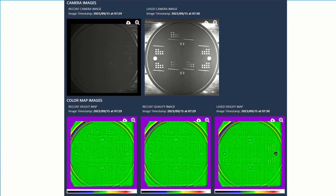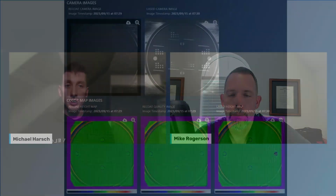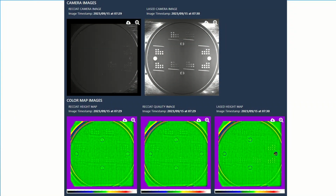And then we basically want to see what the powder bed roughness is. So how is the quality of the powder bed? And do we see any excessive protrusion of the part after the lasing is completed? And maybe if you bring back that picture on the bottom right, that little cone on the bottom right, you can see obviously something here is going wrong. We have some excessive protrusion, and this is the data we are looking for. This is the data that helps us, first of all, understand if our process works correctly, and second of all, if the allowable protrusion is within the limit of our process. So basically between 0 and 800, 900 microns, depending on the material.